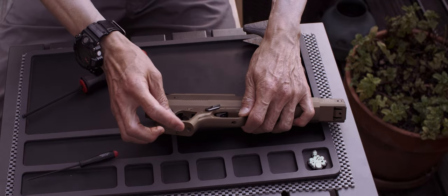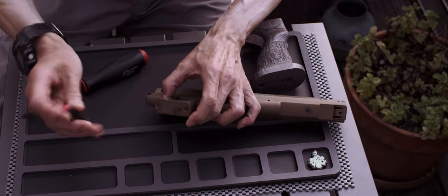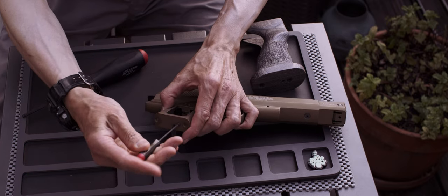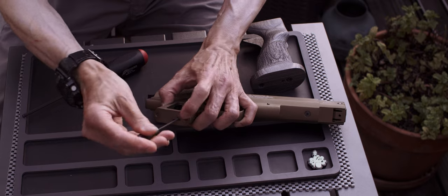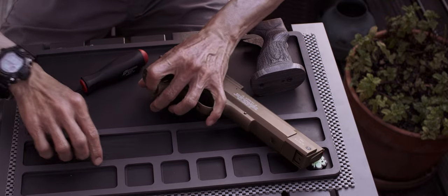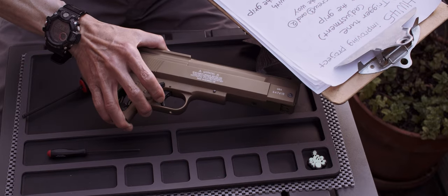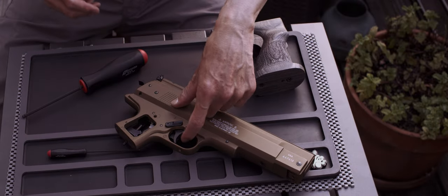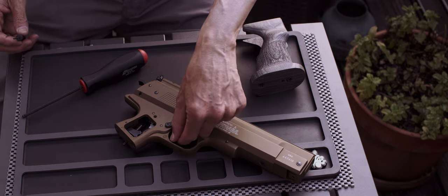Then turn in this screw, screw 3, until it is flush with cross member. Now, there should be a lot of free play. Now, what I need to do is turn screw 1 in all the way until all the free play is removed.